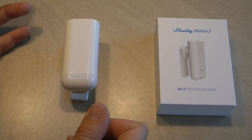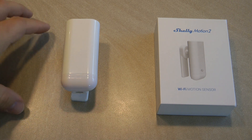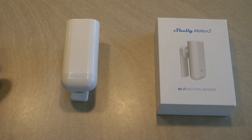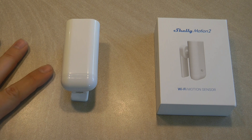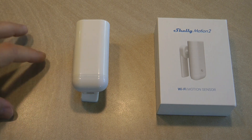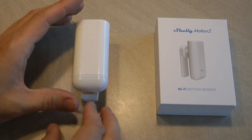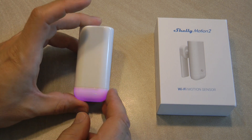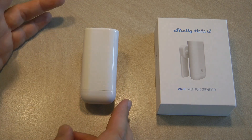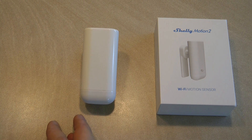Being a Shelly device, you can configure it within the Shelly app to communicate directly to other devices. It can also send data over MQTT and integrate with your home automation system — for example, Home Assistant. Within the Shelly app you can create automations as a scene, such as turning on a light when motion is detected. You can configure direct URL actions or webhooks that talk directly to other devices like a Shelly lamp without any servers in your network.